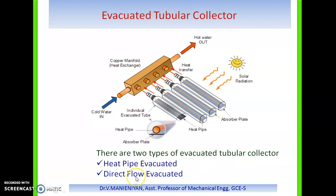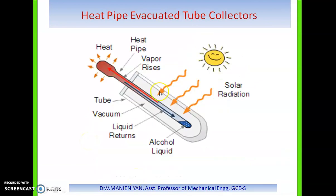There are two types of evacuated tube collectors: the heat pipe evacuated system and the direct flow evacuated system. In the heat pipe evacuated system, a sealed heat tube — usually made of copper to increase collector efficiency in cold temperatures — is attached to a heat-absorbing reflector plate within the vacuum-sealed tube. The hollow copper heat tube is evacuated of air but contains a small quantity of low-pressure alcohol or water liquid, with additives to prevent corrosion and oxidation.